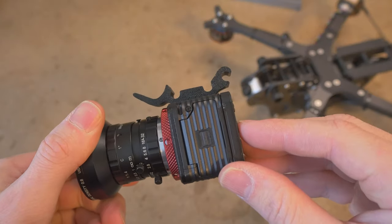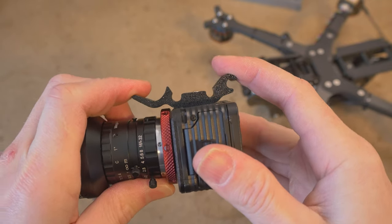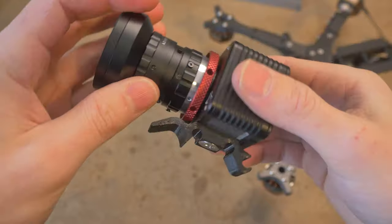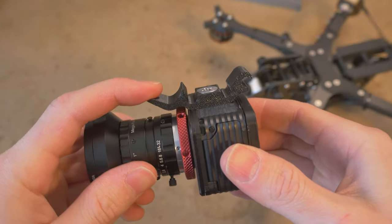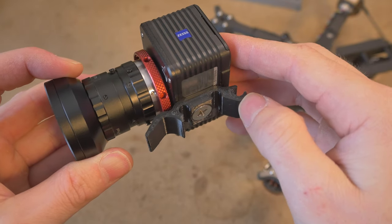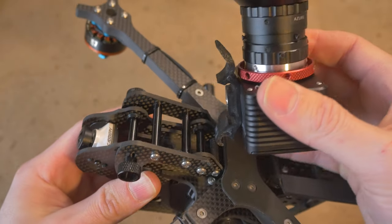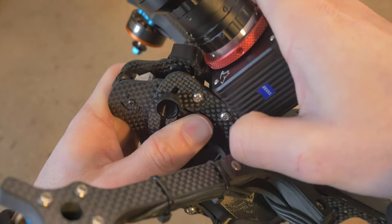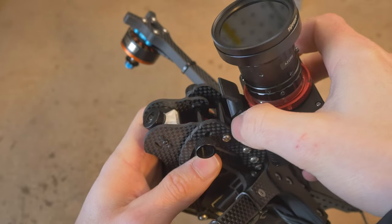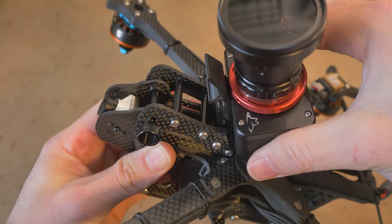The quick release mechanism is 3D printed out of PETG, which I found is a suitable material because it has a little bit of flex and can undergo a lot of mounting cycles even in cold weather. I've thrown it in the freezer and clipped it on multiple times just to see if I could get it to fracture, and it held up just fine. A benefit of using a 3D printed clip is that the STLs are free to download on GrabCAD and you can print as many as you like for as many cameras as you want. It has a three-point mounting mechanism: it clips into the rear standoff, then clips into the second and third standoffs, and a little lever allows you to pull up so it releases on the front standoff, then you twist the camera slightly to release the rear.